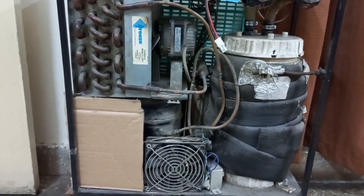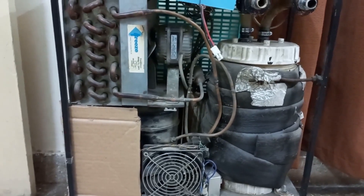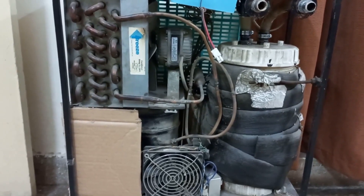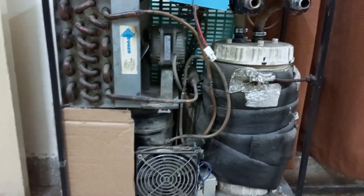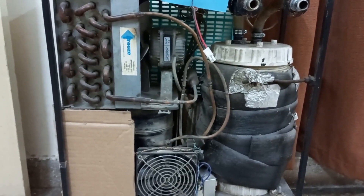The current is high because it has an FR11G compressor — its current is 2.2 ampere, and if it runs continuously, the electric bill will be too much. So to reduce the electric current, I use a running capacitor with this, and its current decreased to 1.5 ampere.